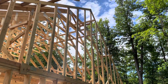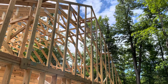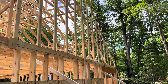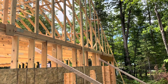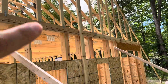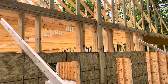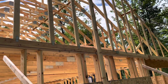Here's the last gable end truss we set. As this one went in I did the same thing — attaching two-by-four bracing across the top on either side. It's a bit messy because they're on two different planes since it's a dropped end. I also put in a guide in the middle — not a strong back, more just a guide — so there was something to attach that last truss to and make sure it was on plane with the wall down below. Got that installed, nailed it in across the bottom, and that was it for that end.